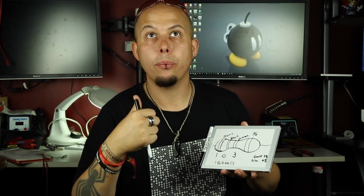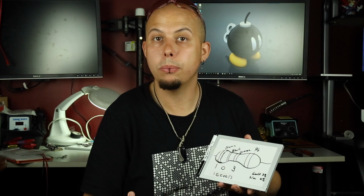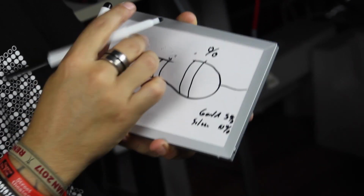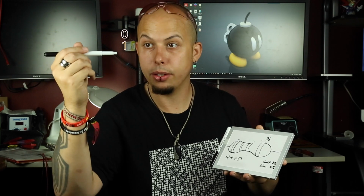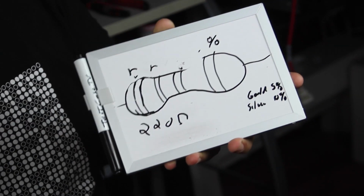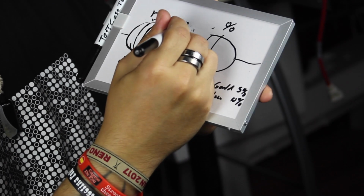Another thing would be, once we get really into the LED talk, knowing how to select a resistor for the LEDs. For instance, if you have a 220 ohm resistor, let's go for that. So say we want 220, right? 2, 2, 0. So it's black is 0, brown is 1, red is 2. So I'll go red. Next one's going to be red. And as far as zeros, I have 1 zero after that. Red, red, and then brown. And that's my 220 ohm resistor.